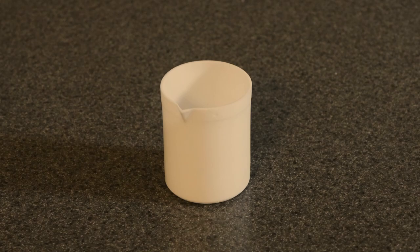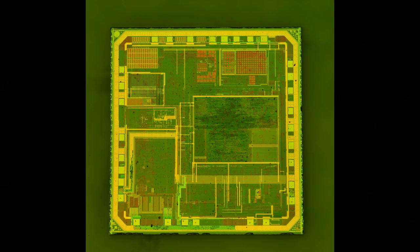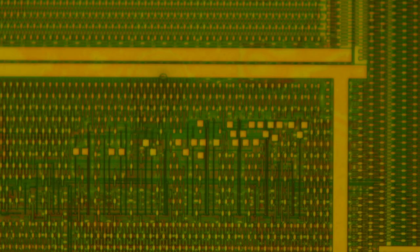Here's a chip on the surface — I think this is from Texas Instruments. You'll see all of these little squares on the surface, which is filler material to make sure there's something in that region. It increases manufacturing yield. In order to remove it, we boil the chip in hydrofluoric acid and clean it with water. As we remove those layers, we can clearly see different organs of this chip. You can see that in the center there is a sea of gates surrounded by three memories, and there's another memory up in the top left.